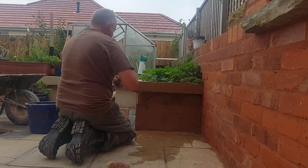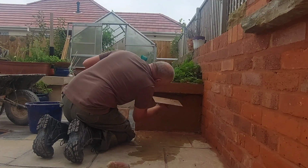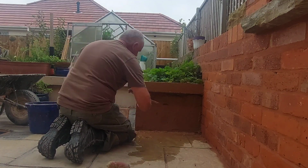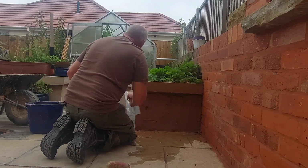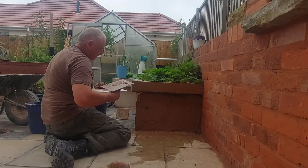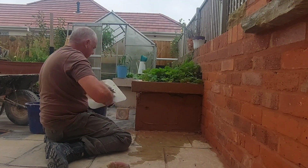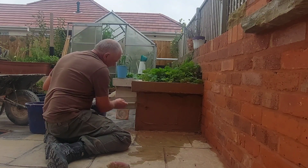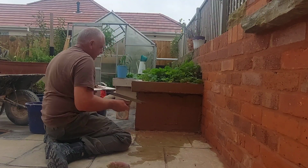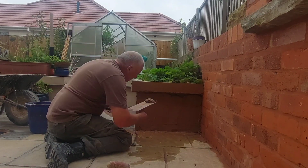Nose of your trowel, get some onto the nose, and push it into that top there. So I stop there in the way. So you don't need to get it too perfect at this stage. It wants to be half decent, but not perfect. Full scratch coat was done a year ago, so it's going to be dry.